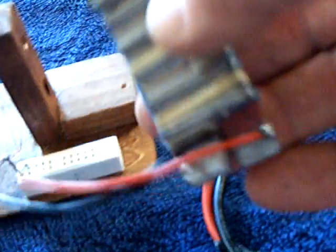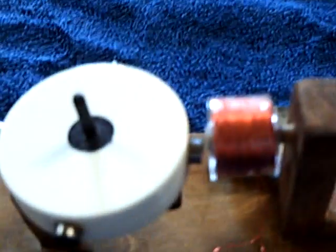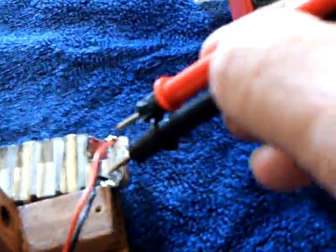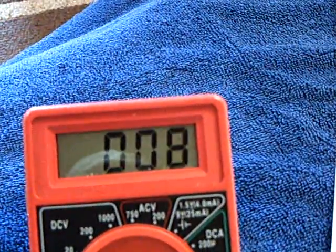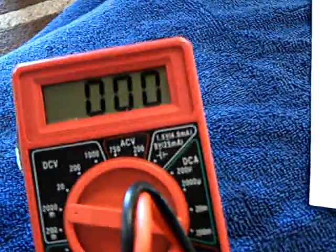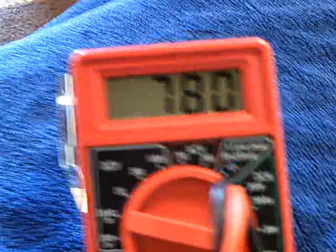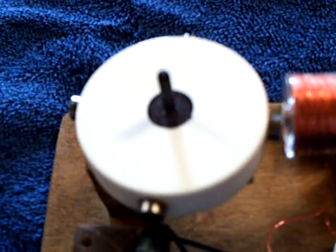This little battery here, I'm going to show running the motor. I'll put this up here on the little device and plug it in. Nothing's going on. Let me show you what the voltage is here with the cell hooked up. It fluctuates around a little bit, but basically when the switch is closed, of course, it's not showing anything. If I rotate the wheel a little bit, you can see the voltage fluctuates some. Let me disconnect the cell — watch this rebound. It's going to rebound all the way up to about eight-tenths of a volt, but it still is not enough to run this wheel.